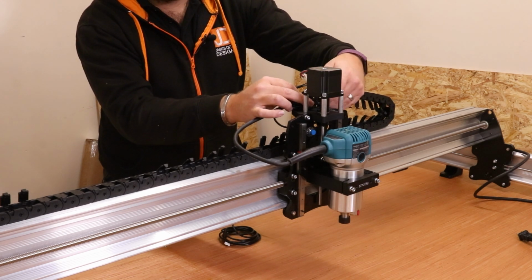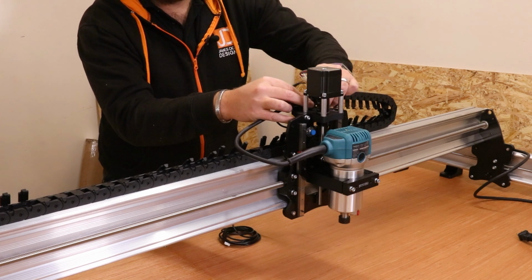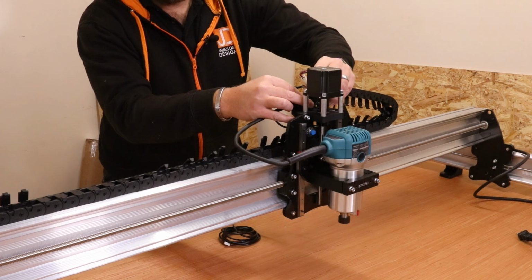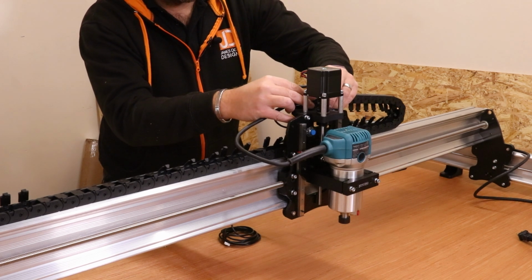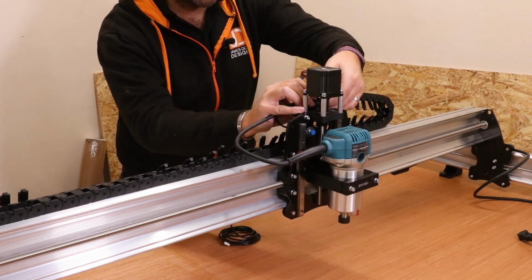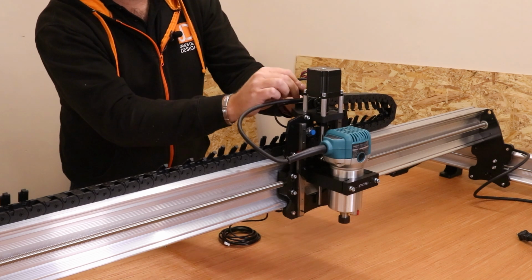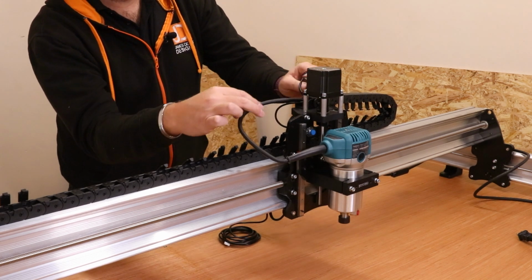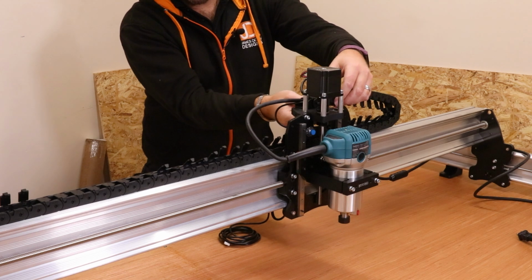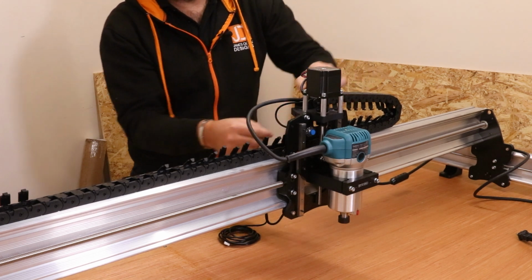You can put the first clip in under and around the cable in itself, and ultimately then clip that back in place. A little bit of pressure, wobbling it side to side, and it goes in, and just put the first clip underneath in, obviously to hold it in place. Now what we can do at this point, obviously we've got a good idea of how much cable we really need in terms of everything, and just start to feed it around the drag chain and making sure it is all seated nice and comfortably inside.